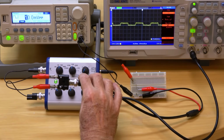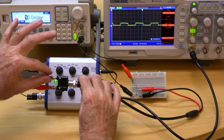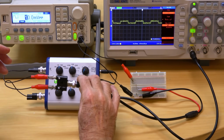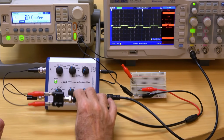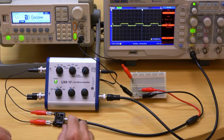At this high gain, you'll encounter thermocouple effects. The metal of the clip and the prong are slightly different. If I warm up one clip with my finger, there's a voltage rise of about 10 microvolts. Warm up the other clip and there's a similar drop. These changes will recover to room temperature quickly, but temperature variation is a consideration with these small signals.